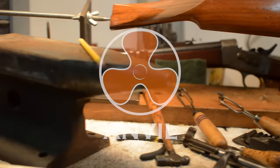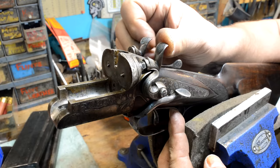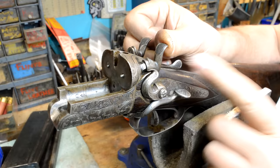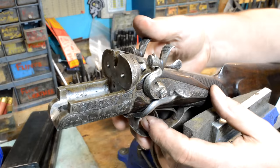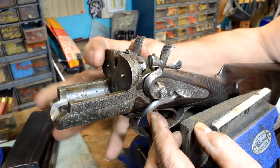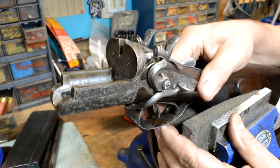This is the left-hand trigger and when the left-hand hammer comes down all the way like this, and if you turn that trigger loose — when the hammer comes back it locks out. So this is the lock, meaning that if you dropped the gun it's more difficult for it to set the barrel off. The right barrel does the same deal — comes down, hits, rebounds, firing pin sticks out, and then when you turn it loose it locks.